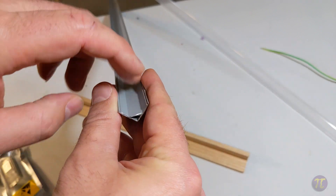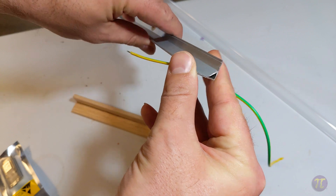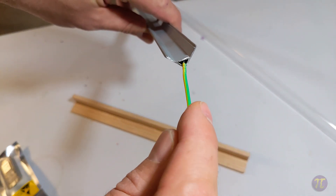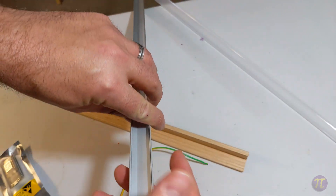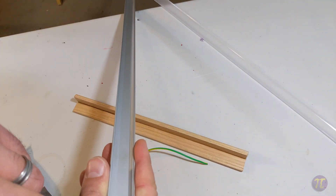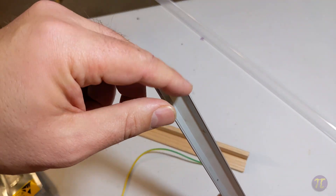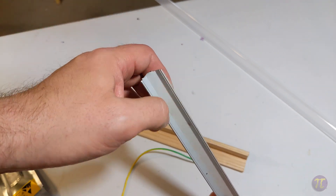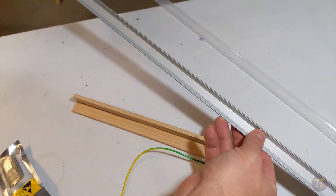With the diffuser over the channel there's not much room, but another benefit of the 45-degree channeling is a small hole in the back where we could fit two 18-gauge wires through from the bottom to power the top with an additional power injection wire. Those two wires ran through the entire seven-foot lamp up to the top, where we cut a hole in the channel and injected power there so it would be evenly distributed.